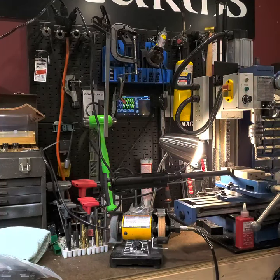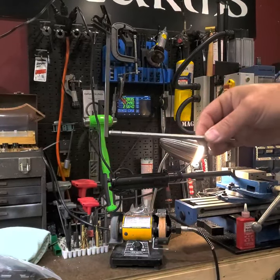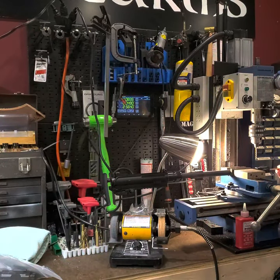Now I'm going to use what we call a reaction rod. This basically slides into the bore of the barrel and gives us our baseline to keep us from drilling through into the barrel. I slide this right into the muzzle — it tightens up, actually made to tighten into the bore, so it's nice and tight and truly centered. This is purpose-built equipment, not a cleaning rod or something improvised. I already have a 3 millimeter high-speed drill bit chucked up.